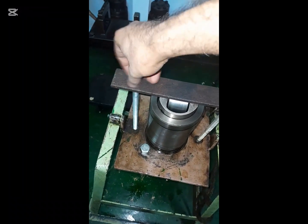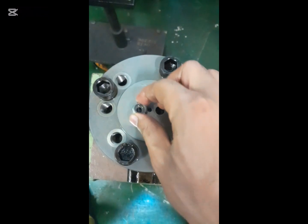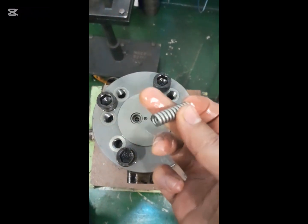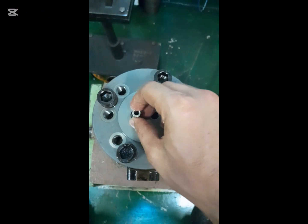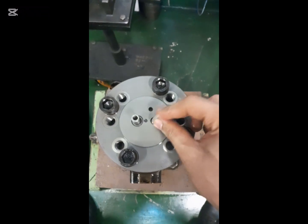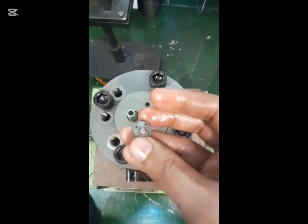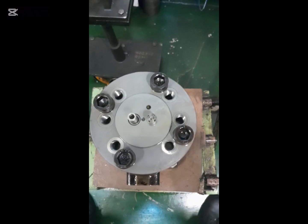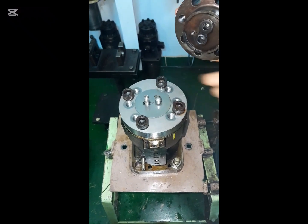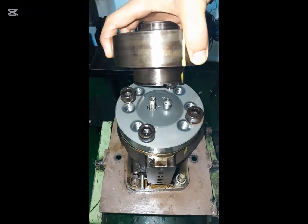Remove the special tool and turn the pump upside down again. Very carefully put back the delivery valve, springs, and constant pressure valve. Notice the matching point of the barrel and delivery valve case very carefully, then put back the delivery valve case onto the barrel.